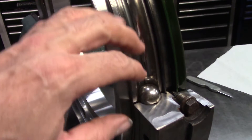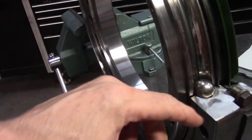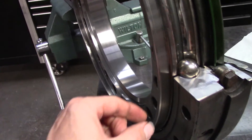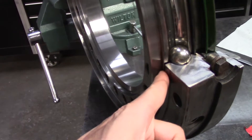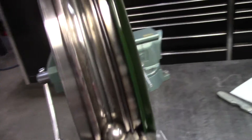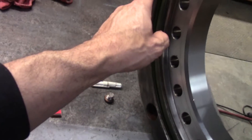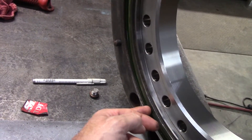So all they're doing — this bearing is permanently sealed — unless you take this whole thing apart and go through all the little plastic pieces and all the balls and clean it all out. The seal here on this side is facing the differential, or the actual support housing. So this seal closes this gap. You can see that. So the grease that's in here originally gets sealed up when it's installed. So that part is sealed. And when you put the bogey on on this side — I can tell because this is where it's got the rust on it — this is where it's exposed to the environment. So this is the seal between the bogey and the bearing.